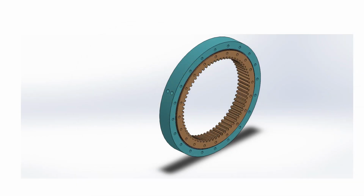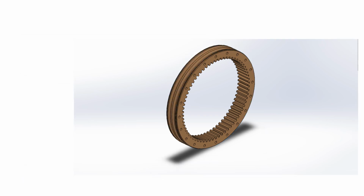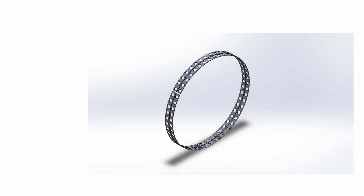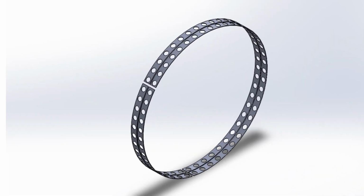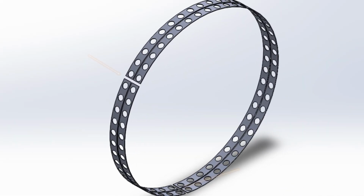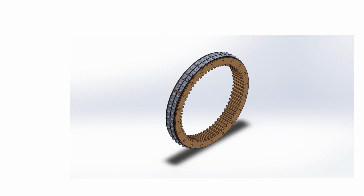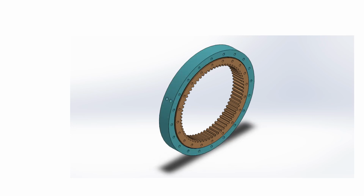The bearing itself is a double raceway ball bearing, which is made up of an inner ring. Separators space the balls, but in newer bearings, each separator is split into two segments. This is to avoid the separator failing when excessive loads distort the bearing. The balls are seated in the raceways. They're inserted through holes in the outer ring during assembly.